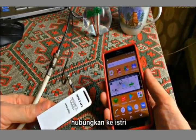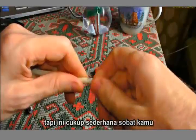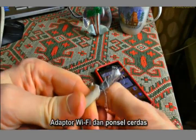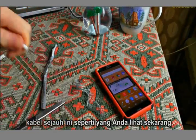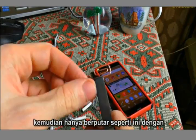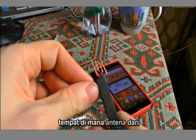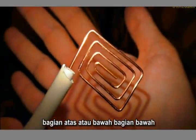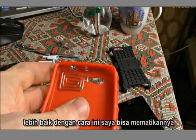What about the smartphone? How do you connect it to the Wi-Fi adapter when it hasn't got the right output? This is quite simple — you have to make a capacitive coupling of a Wi-Fi adapter and a smartphone. Strip the cable to the required length, then spin it into a zigzag shape with pliers and put it close to the place where the smartphone's antenna is located — usually in the upper or lower part. I use a plastic casing to fix it better so I can switch it off easily.